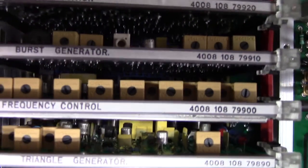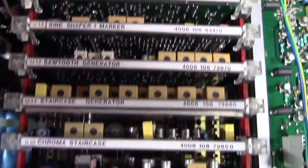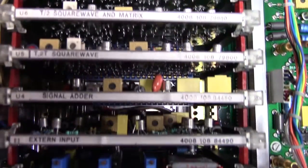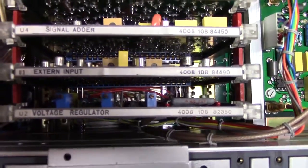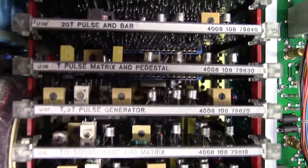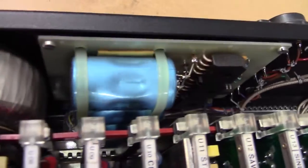Just look at that number of adjustments in there — this is just lovely. Someone spent probably most of the day tweaking all these, back in what I believe is a mid-80s unit. You can see the actually point-to-point soldered backplane in there — that's kind of surprising. I was expecting that to be a board, but you can kind of see that the sockets are just point-to-pointed. And over there we've got some of the power supply with three giant rectifiers and three giant blue Philips caps.